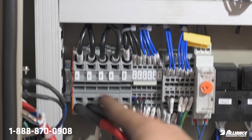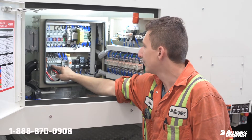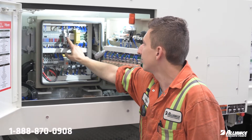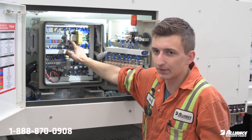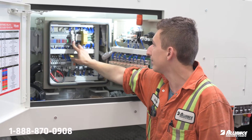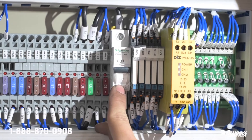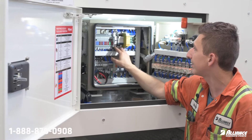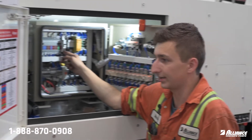Over to P2 — that is fed by the 30-amp self-resetting breaker in the breaker box, coming up through here to the P2 terminal, and then up to this 32-amp breaker. You can see it's green and says off — bad design — but if you see that and your vibrator is not working, flick it up, it'll say on, and your vibrator should work normally if that was the issue. You can check for power at P2 and at both sides of this breaker; lack of power there is a problem.